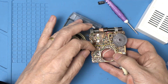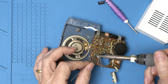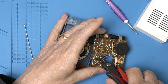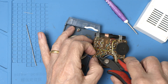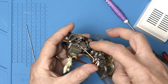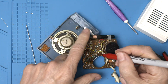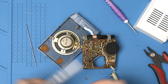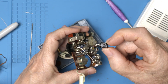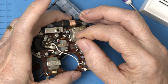Just a little smaller. We have to keep track of here — and if I peek in there I can see that the lead is probably right here. Looks like we're looking at here and here, very likely. Got him — it's 50 microfarads. The plus lead is over to the left; long lead is the plus lead, so it goes in like that.